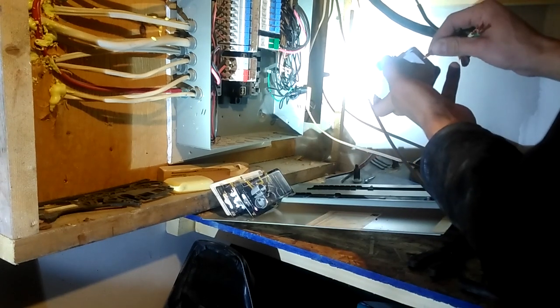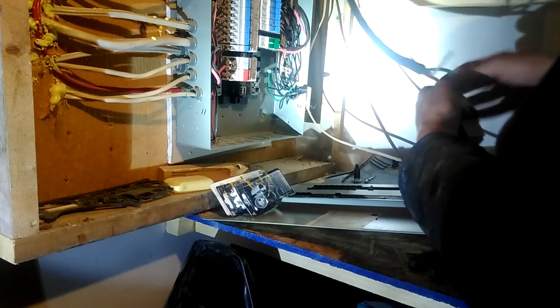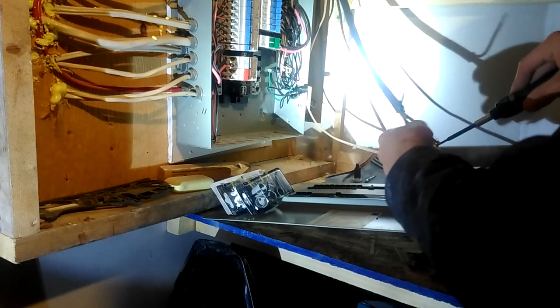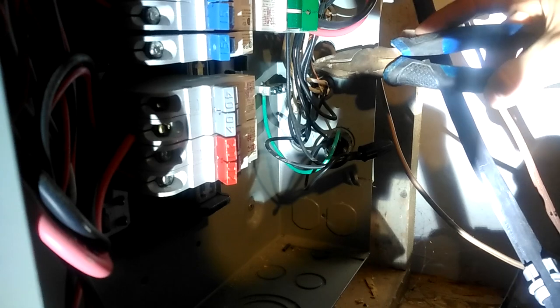You can tell the ground bus bar because it's bonded to the casing of the panel itself — there will be a screw or bolt holding it to the panel, so you know it's grounded. The panel itself should be grounded as well. The white is the neutral — that goes to a bus bar with a bunch of other white cables. Find a knockout in a good spot and knock that out. Make sure your power's off if you're reaching in there with pliers. I didn't, because I wanted light for the video, so I was very careful and wore rubber-soled footwear so I was not grounded. I also got a little protector ring from Canadian Tire for the panel — that ensures your cable isn't going to get cut rubbing on that sharp sheet metal. Put that on your housing — I had to modify mine a little because the 10 gauge wire is so thick.